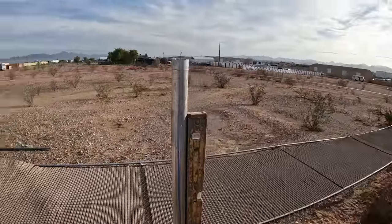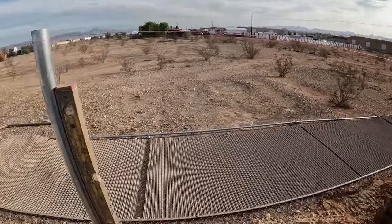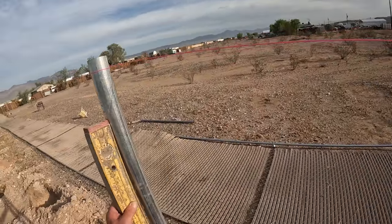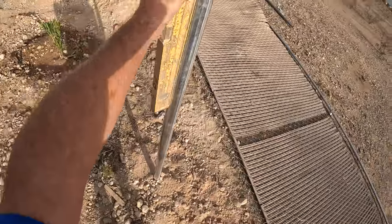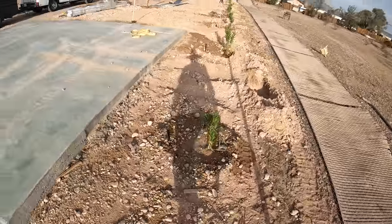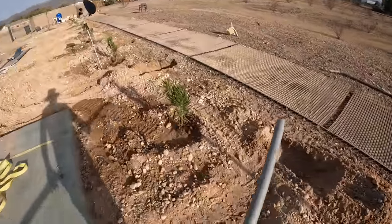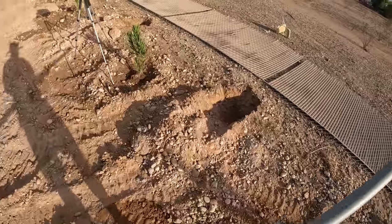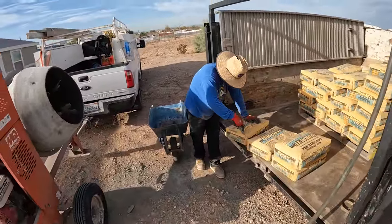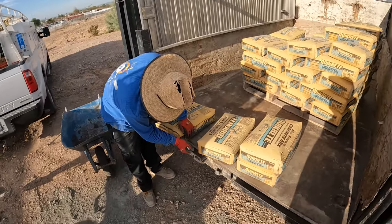Let's take a look at this little jewel — we set this last night, a little line post. We're looking at 200 feet of failed fencing. This is kind of going to get the sag out of the line, and it's setting real pretty right now. What we've got around this post is 160 pounds of concrete. On the old system, we were lucky to have 100 pounds. These pipes are getting piping hot already, and here we are at 8 in the morning. We have a full pallet of 80-pound bags and we're going to use all of those putting this back together.